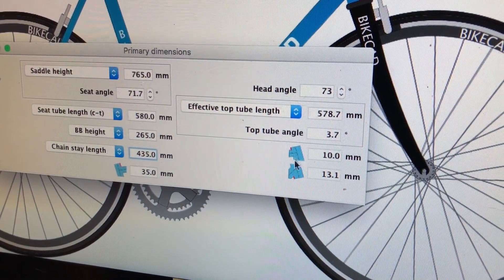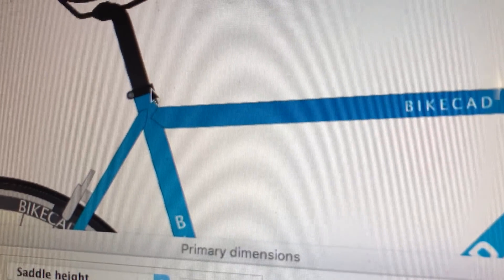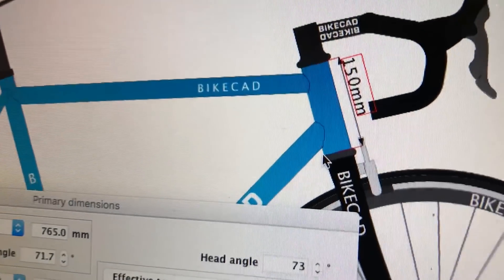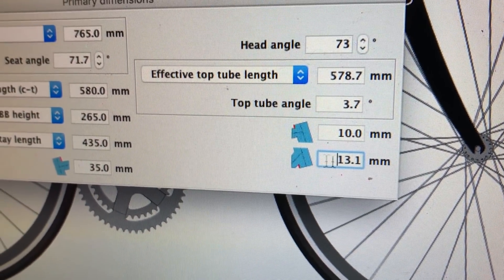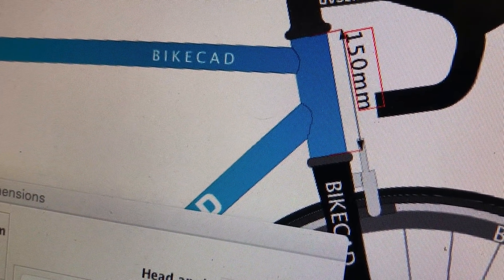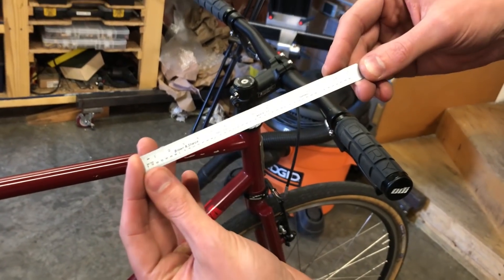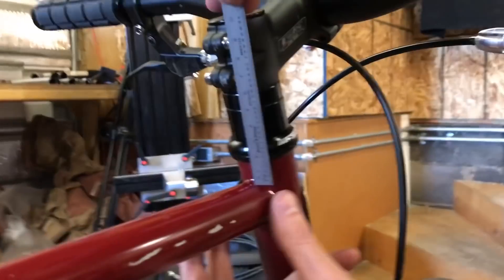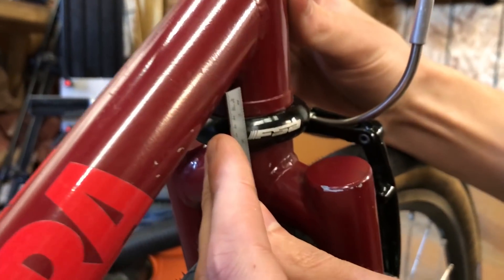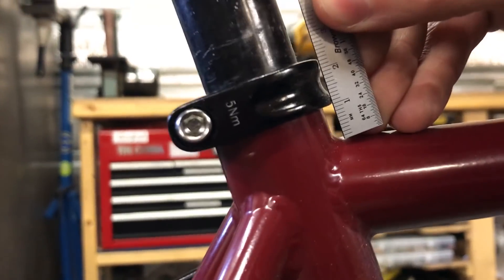These variables here have to do with the space between the top of the tube and where it joins — like the top of the seat tube and the top of the top tube, or the top and bottom of the head tube where the top tube meets it. If I change this from 13 all the way up to 25, you can see that move in the model. I'm going to take rough measurements with my 0-to-150mm scale — just eyeballing to get within a millimeter or two. It looks like maybe 13mm at the top and 20mm at the bottom.